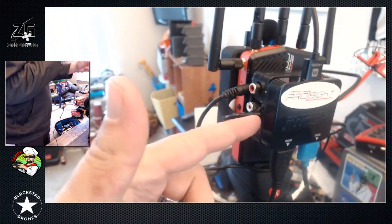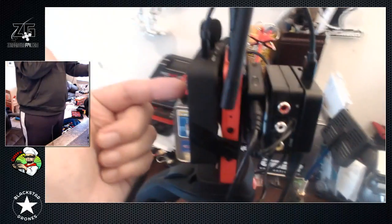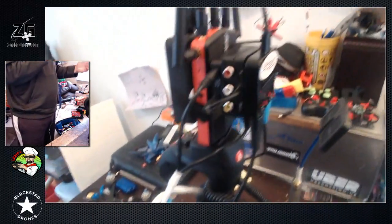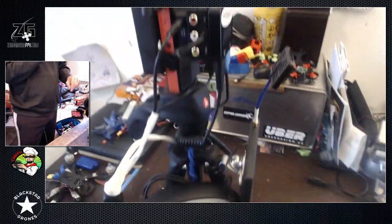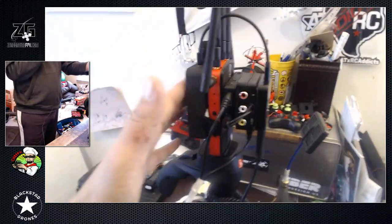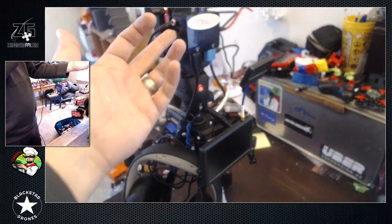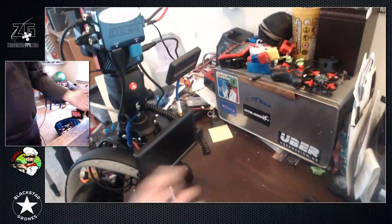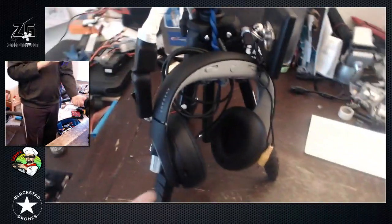Once this is disconnected, it reads this one, and pumps it out into the DVR, the digital DVR, and into the splitter, and then again out into my Avegant Glyphs. So now I've got two different analog signals, 3.3 and 5.8, that I can throw into the digital box for DVR, distribute to my glyphs, and my monitor, in this situation for the 3.3, it would display off of the Coil HDMI. So that's my analog setup now running Avegant Glyphs.